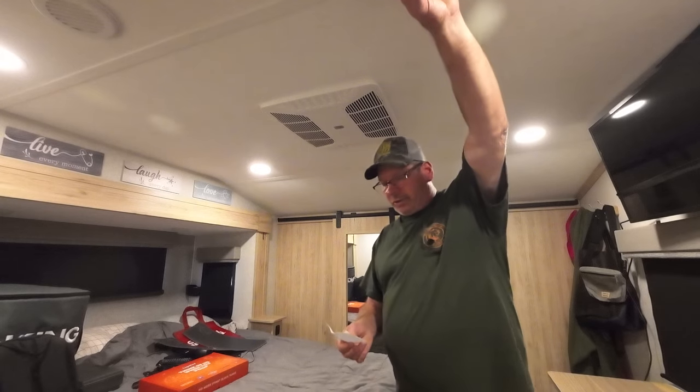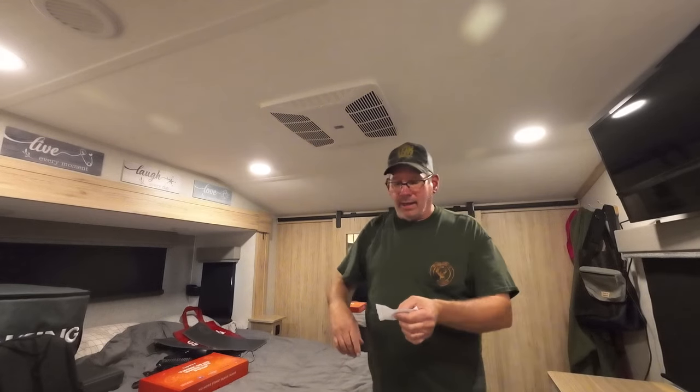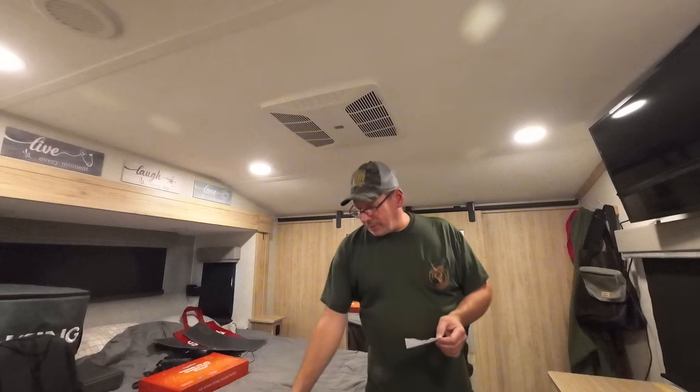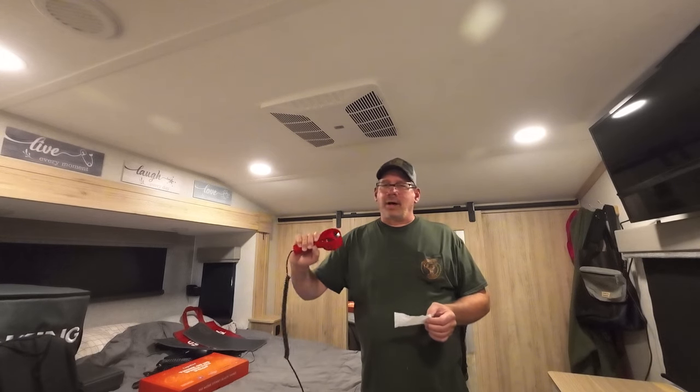Okay, so on this vent up here, which you can't see, right now I'm getting 1,350. Before I was getting 1,275, so it's an additional 75 feet per minute. And then on the vent over here, which I think you can see, yes, now I'm getting 1,050. Before I was getting a little under 1,000, like 990. So I got about 55, 60 additional feet per minute. And then in the bathroom, now I'm getting 850. Before I was getting around 800. Now this isn't exact. If you move it around, you get different readings, but I kept moving around trying to get the highest reading I could.